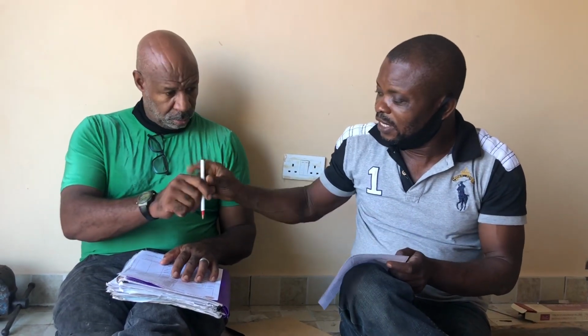So digging the foundation, I'm just going to give you the estimate now. Digging the foundation will take us probably 4 days. Four days to dig the foundation? Yes. Like I said before, we are not going to dig the foundation for the size of a bungalow, though we are building a bungalow. We consider your area. In such a swampy area, we do a foundation of a one-story building. That means we must go deep to 1.5 meters. That's the foundation size for a story building.